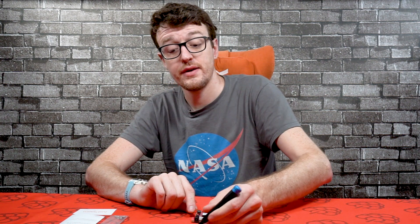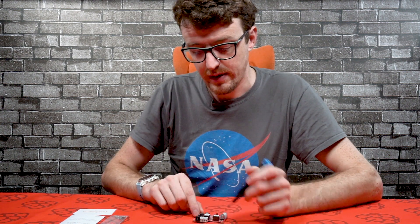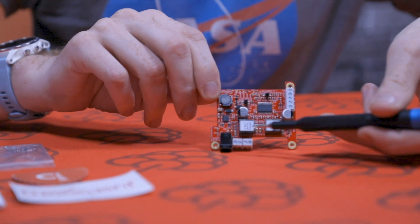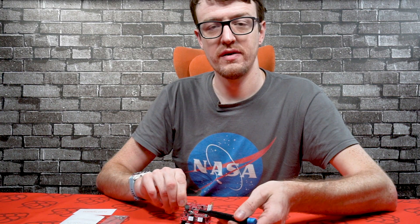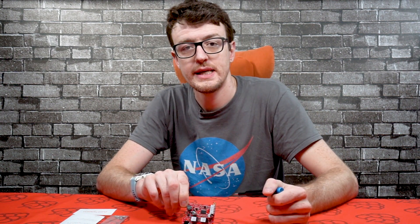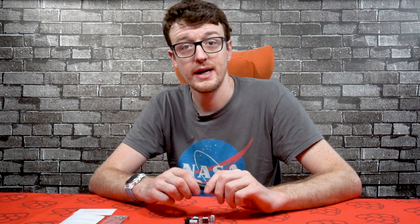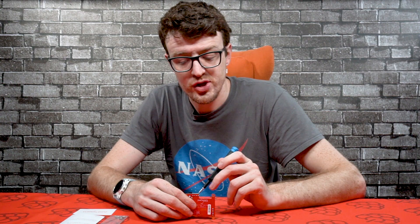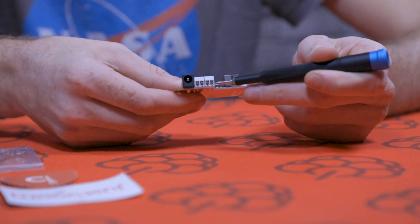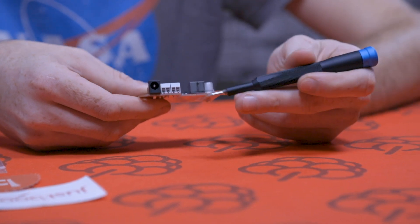I'll link to the page where we've got a table laying out all the power supply information in the description of the video. Next to the power input, you've got two screw terminals — it says SPK L and SPK R — speaker left and speaker right — with positive and negative marked so you know which polarity to use. This can take up to 14 AWG cable in both the inputs and outputs, which is enough for the power going through them. We've managed to do 12 AWG, but we recommend 14 as the max to ensure a really solid connection.